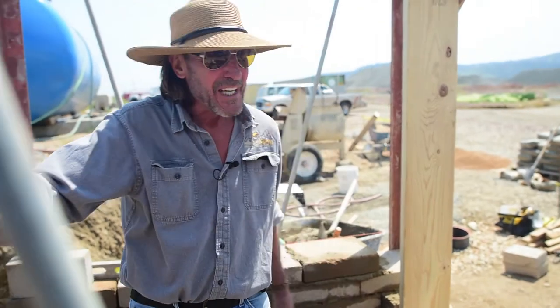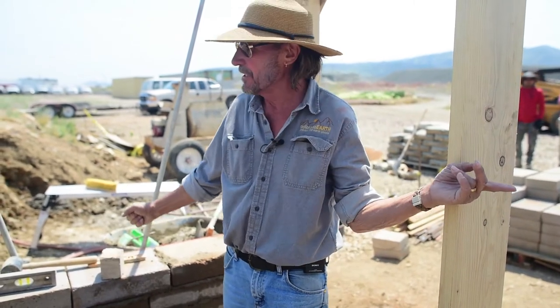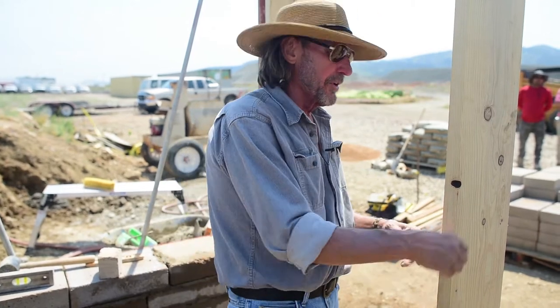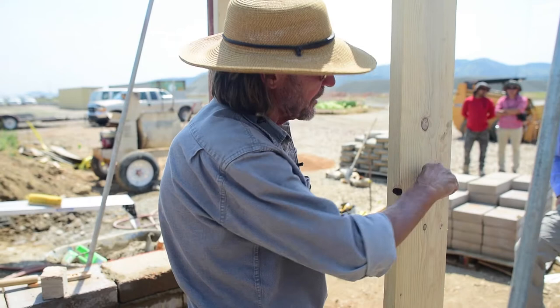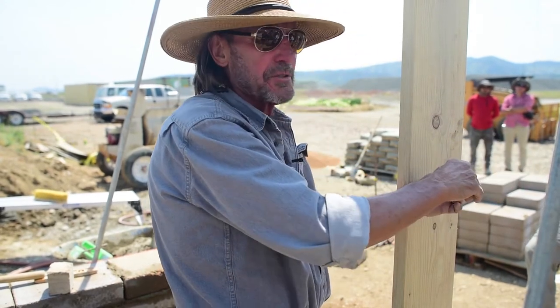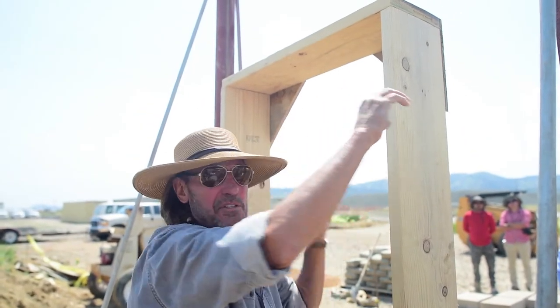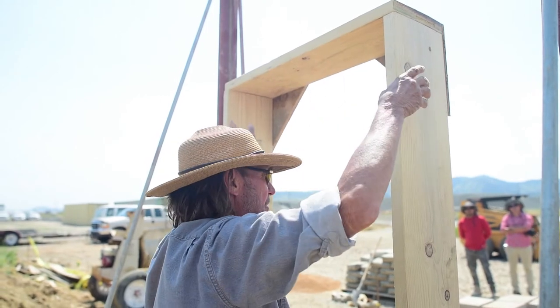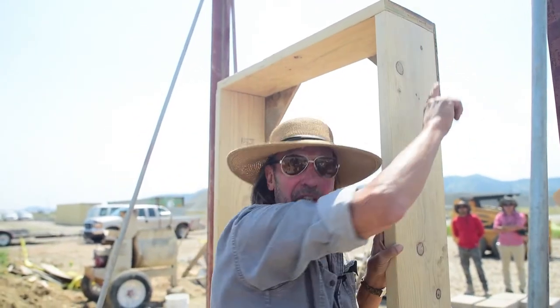Light switches are at 48 inches, and that is a code. Light switches are almost always by a door — you walk in and reach over to hit the light switch. So you've got this wire coming over for the switch and the light, and you run it right up the center of the buck on the outside. When you get to 48 inches you stick it out, the course comes up, you put your box on, the wire in it, and then it needs to continue up to the light. This part's easy, and then you get to the lintel — a wooden beam that's going to go over the door. That wire at that point either has to go around the lintel or through the lintel.